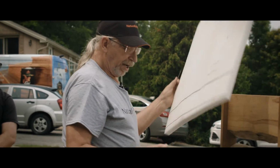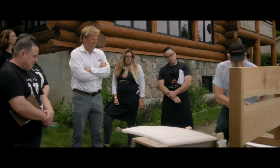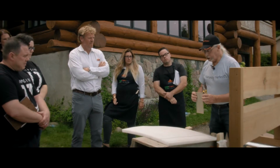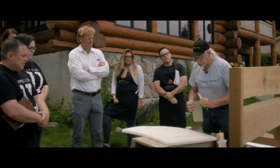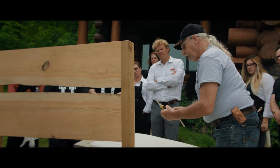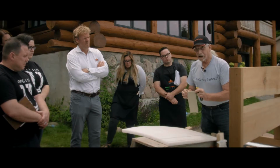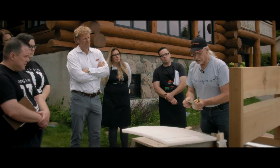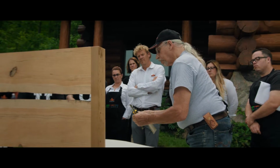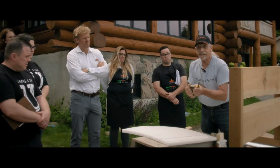Now, the next thing to do, the reason I cut this stuff in this manner is I have a sample of the chinking here, the way it's done. You'll see that it's like a wedge on either edge, and it's about 1/8 of an inch thick in the middle. This is so it'll give a better bond on the edges. It gives it more strength, and it allows it to stretch, because you can stretch it right out, you can't tear it, eh?